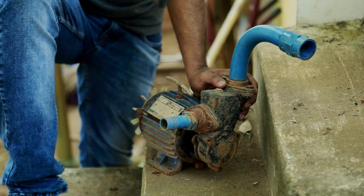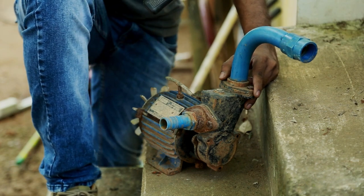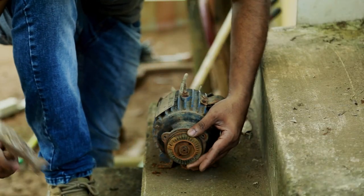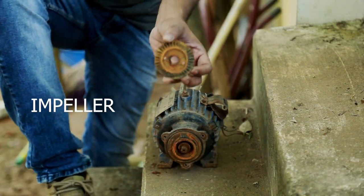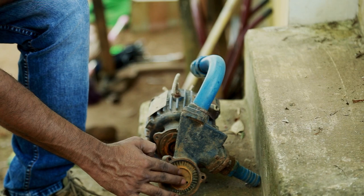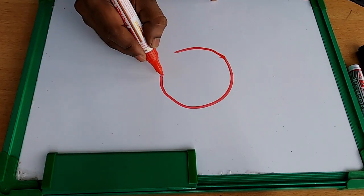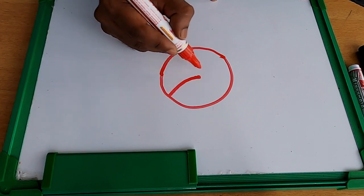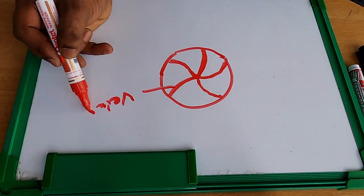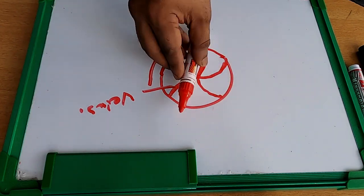Okay, let's open it. This is one old water pump I have here. We are going to study the water pump section - the centrifugal pump section. When you open the pump, you can see a disc here. This disc is called an impeller. This is an open impeller - there are many types of impeller. The impeller is set inside a small casing called a volute casing. The impeller looks like a metallic disc with elevated carved metallic lines starting from the center and running towards the periphery. These lines are called vanes of the impeller.